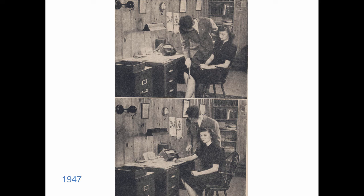So there you go. Because the fact is, she is producing enough BTUs to stay alive right there. So at her desk, she's producing about 500 BTUs per hour, as are you if you're sitting at a desk right now. Your body needs 100 BTUs per hour to maintain life. That's enough to keep your brain thinking, your diaphragm moving in and out, and your heart beating. You only need 100 BTUs per hour. The other 400 BTUs is a safety factor, and that must be shed. If it's not shed, you're going to die. And it's shed in a very specific way.